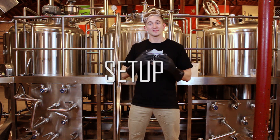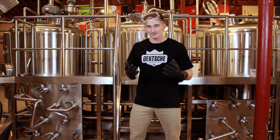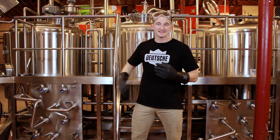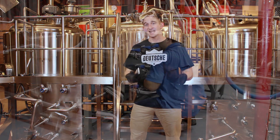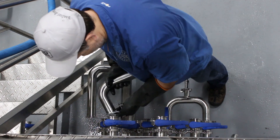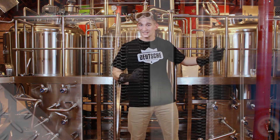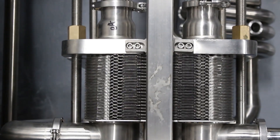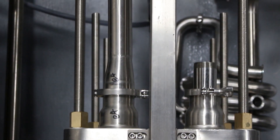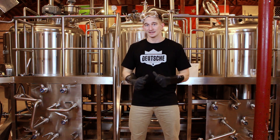Next biggest thing is setup. What that means is trying to set up your process piping to involve as much of your CIP as possible. Any piping that's hit with wort during the actual brewing process has potential to hold on to sugars, proteins, and any residue. So you want to make sure that it's involved in your CIP circuit so that it's getting flushed. Try to work in your heat exchanger as well — you want to make sure that it's getting back-flushed to clear out anything that could get stuck in there. The more process piping and process flow you work into your CIP, the more efficient and the more you're going to get out of that CIP.